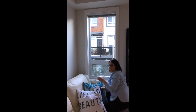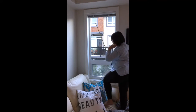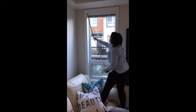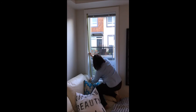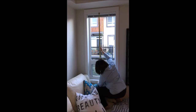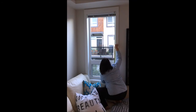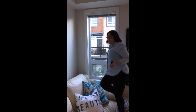Then you do your height. Go from your outside corner and measure down — about 63 and a quarter. Then go to the center and do the same thing — probably 63 and a quarter — then go to your outside corner on the other side.